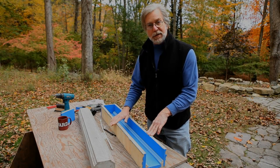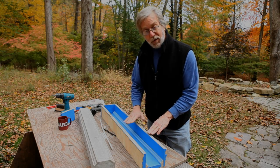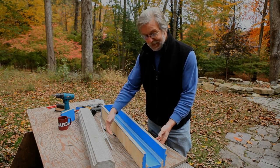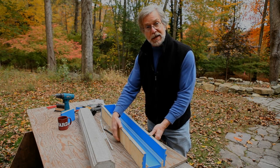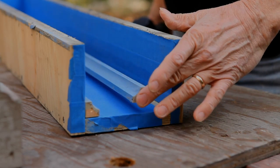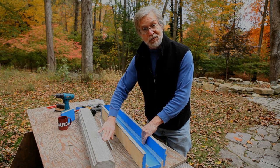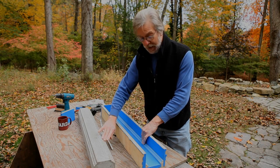This is a project where we're making some pilasters for a concrete fireplace surround. This mold is simply made out of some three-quarter inch plywood assembled with drywall screws along the sides, with cove moldings at the bottom — and that gives us this little rounded reveal edge along the edge of the pilaster.